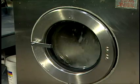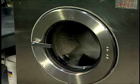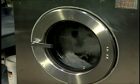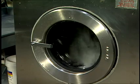As the interior drum rotates, the garments become saturated with the bath. Typically, after the drum rotates in one direction for a specified number of cycles, the direction reverses. This prevents the garments from being tumbled into a dense mass and keeps the bath circulating evenly throughout the contents of the machine.